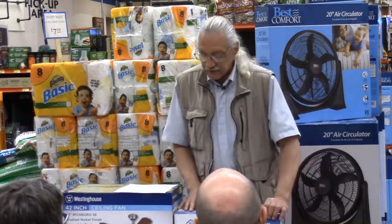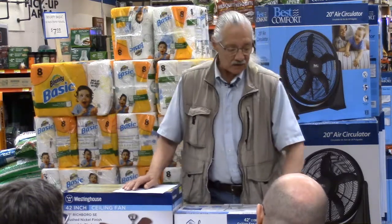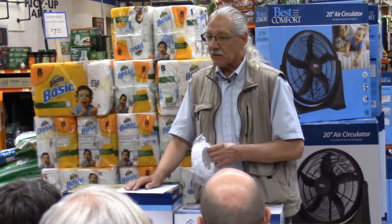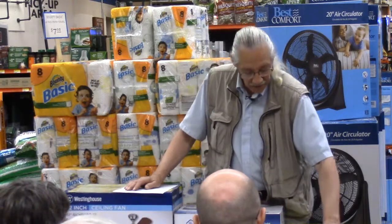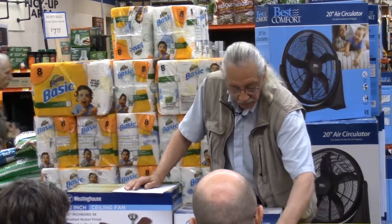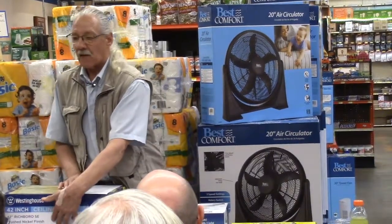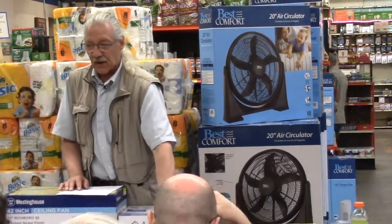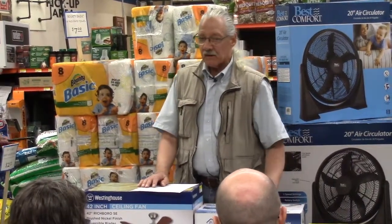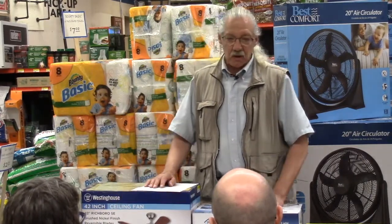If you do have an old box like that, I would recommend, instead of the hugger type, always go with a down rod type, because if you need more room for your wiring, without disturbing it, you can always add an extension collar like that to go along with the canopy. And those extension collars only work with the down rod type. You can't get an extension collar this big for a hugger fan. So if you're dealing with old wiring, I would always recommend going with a down rod fan as opposed to a hugger fan.